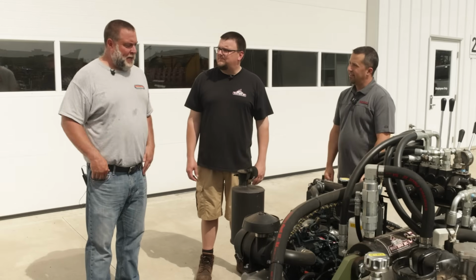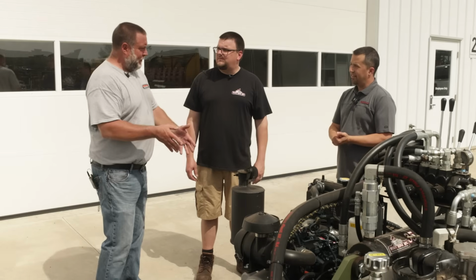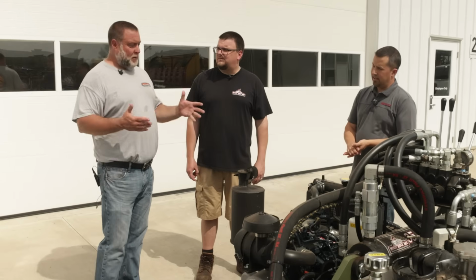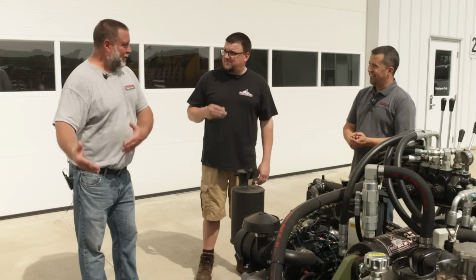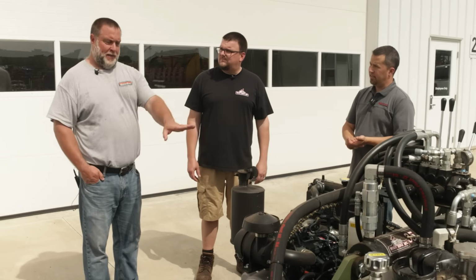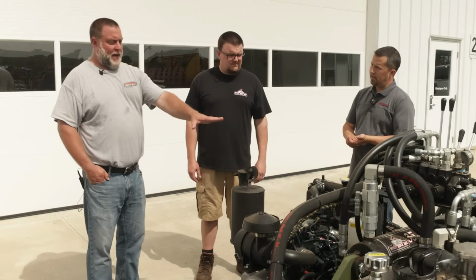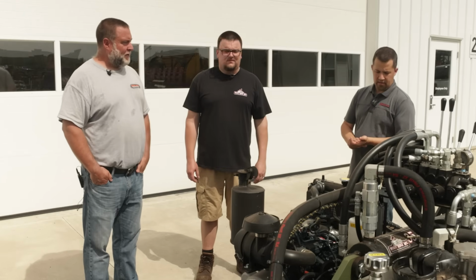When I had the 35C with the GX Honda motor in it, I could run about 2 hours, and then I had to shut the machine down, let it cool a little bit, and refuel it. Through an 8-hour day, you're doing that 4 times, which adds up. It's also the amount of fuel you're going through. I actually added a fuel barrel at the house because I got tired of going to the gas station. Then as our business grew, I had a hard decision between the 25 horse gas and the diesel, and I chose diesel because of fuel economy. I can fill this tank up once in the morning and run it for 3 days without having to stop.